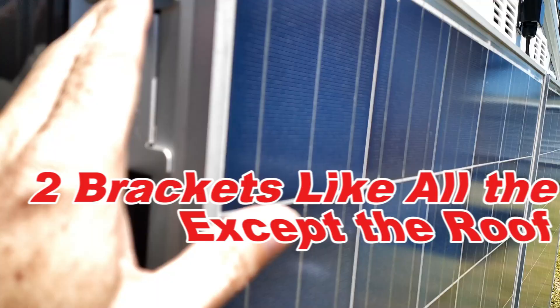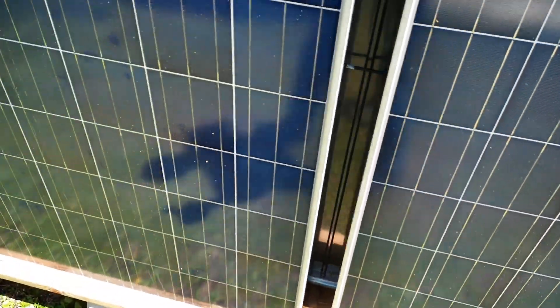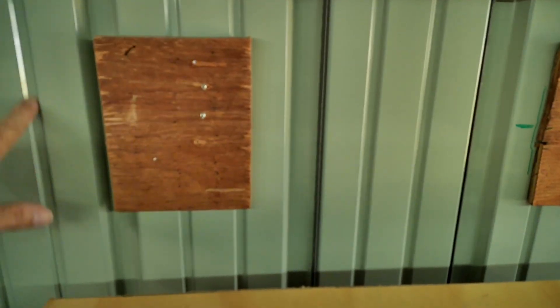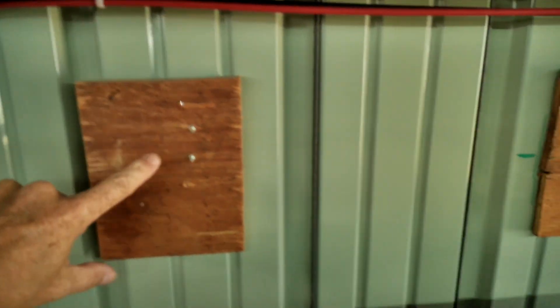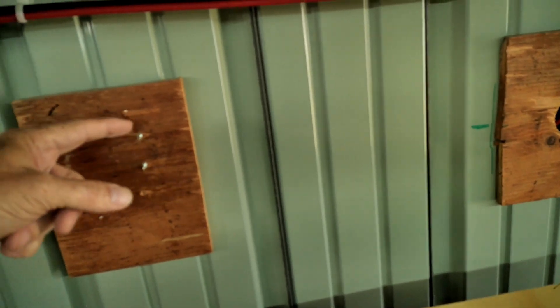At the top it has two brackets, so I got away with using only half the brackets — aluminum brackets that screw in and are attached on the back. I'll walk around to the inside and show you the back of these panels and how they're attached. This is a backing board I'm using to spread out some of that pressure coming from the panel mounts. The idea is to use a backing board that these screw into to distribute that weight to a larger area and provide support from the main frame at the top across multiple screws. I may even make these boards bigger so they go all the way up to provide the full backing of the wall.